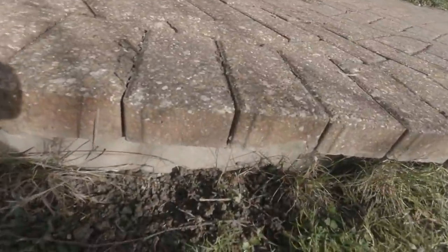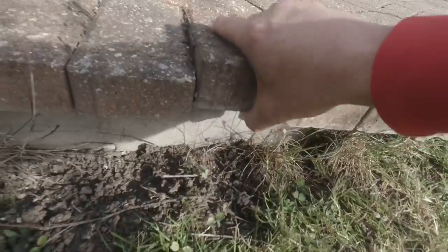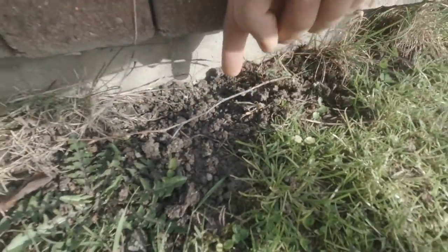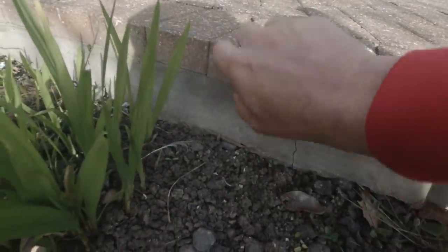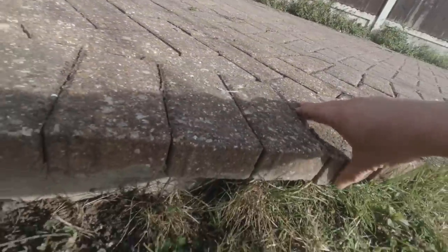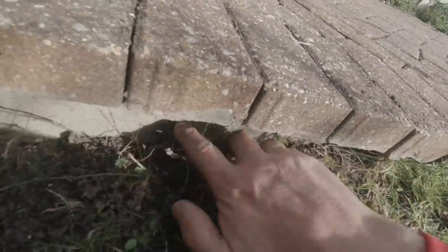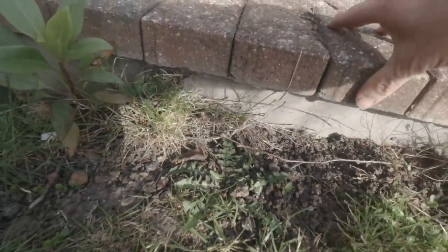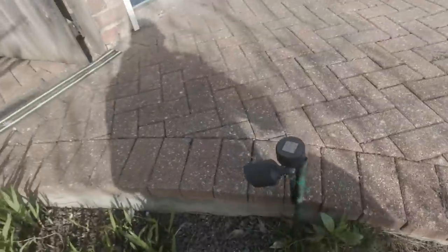Okay then, so I'm here on this little job and this seems to be one of the problems. We've got some loose block pavers here, they've all come off. Doesn't seem to be enough gear underneath the end here. I would say that should have been flush. It's flushed up this end and they seem to still be stuck on, but they've come loose where there's not enough muck underneath there. So I'm going to get some more muck, pull these up and re-stick them on, break some out.